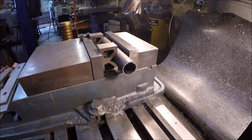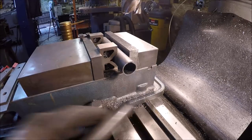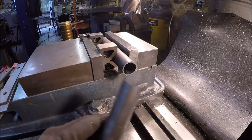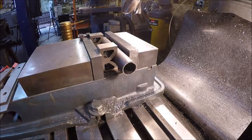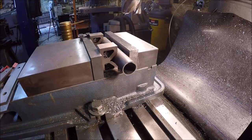I got you over here at the mill. I am just notching the legs that are going to connect the lower metal circle to the upper metal circle. I've got six-inchers here and we're just notching them so that they'll weld right on up. I figured I'd do one on camera — it's a one-inch annular cutter for this one-inch tube. Cover your ears.